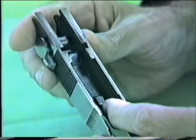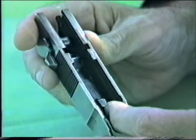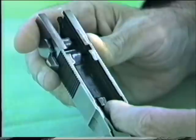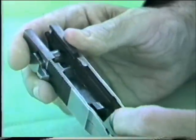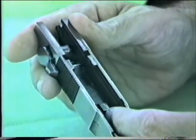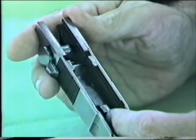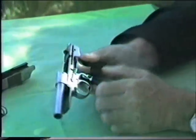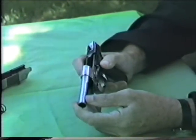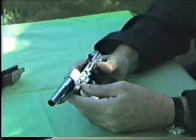So there's a separate bolt insert in here, and in case of changing the barrel for a radically different caliber, such as 22 caliber, the bolt insert can also be changed and have a different face on it to fit the 22 caliber cartridge, for instance, and also contain an offset firing pin. In addition to that, it also enables me to use a fixed barrel. The barrel is rigidly mounted to the frame, but it can be easily removed to be interchanged with other calibers